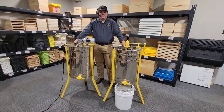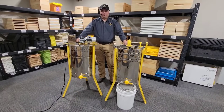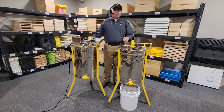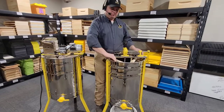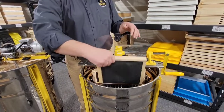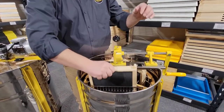Hey everybody, this is John with Hilco and I'm here to introduce you to a couple of new extractors we've been working on here for the last few months. We call these guys our Enduro line of extractors, our excellent hobby level extractor. They extract three deep frames in a tangential configuration. Tangential means that you have to spin out one side of the frame, then you stop, flip the frame over, and then you extract the opposite side of the frame.